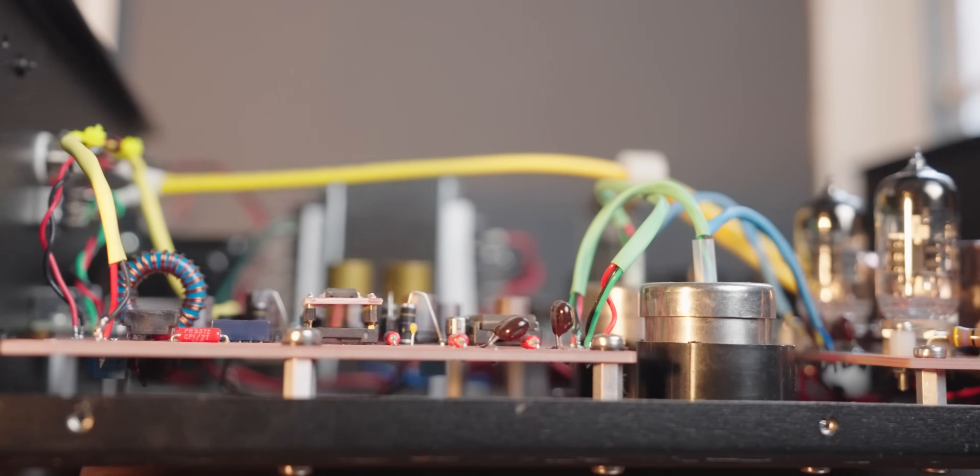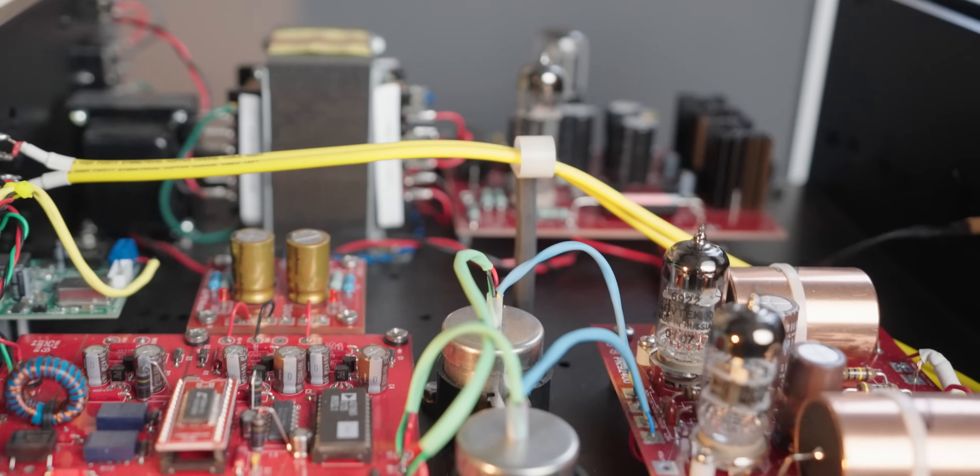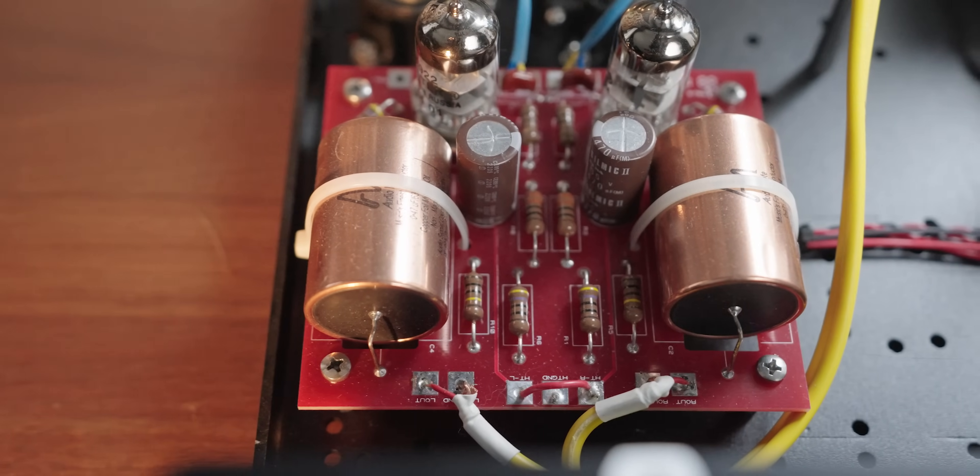Mundorf, Aona, Audio Note capacitors — yes, please. This is great parts for a $1,750 DAC. At this price point, I think this is really enticing in terms of the parts used, especially the signature version. Considering that the 0.1X from Audio Note is the entry-level DAC that uses tinfoil Audio Note capacitors, you get copper foil — which is a step above the tinfoil Audio Note capacitors — in this unit at half the price. Of course, parts used isn't everything, and there are other better parts on the 0.1X than this unit as well. But just the fact that you have higher grade Audio Note capacitors — copper foil instead of tinfoil — in the unit that's half the price, I think that is a very, very enticing deal.